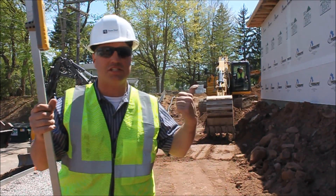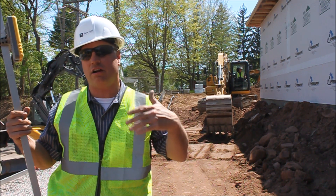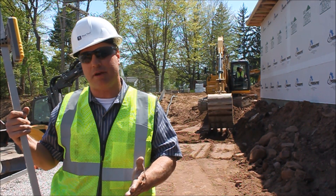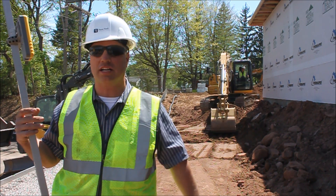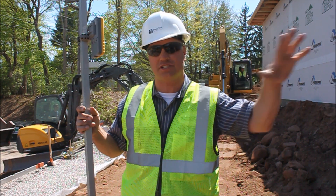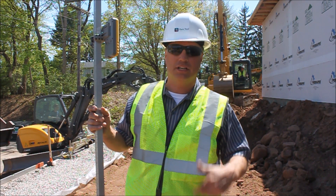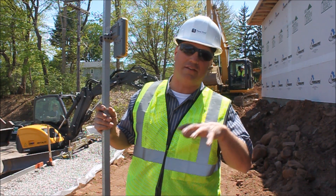Step one is obviously taking that precaution and getting the proper base. Like I said, a couple hundred yards had to be moved off this site. You can see behind me we got a larger excavator in here, able to bail out a large amount of that soil to get down to the base where we need to be. Grid was on the base course, so obviously with a lot of soils to move and a tight area, all the soil has to be removed on either side because the building is here in the middle.